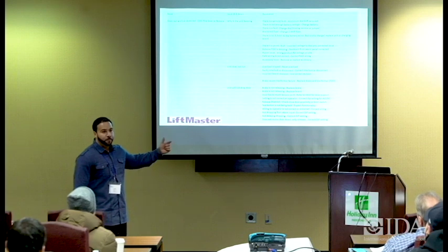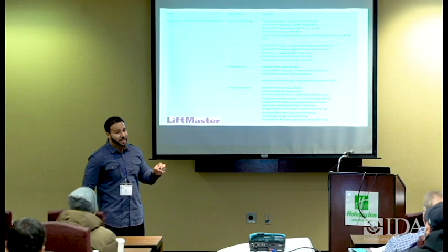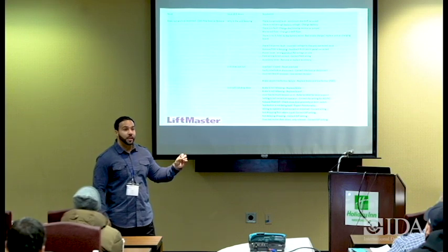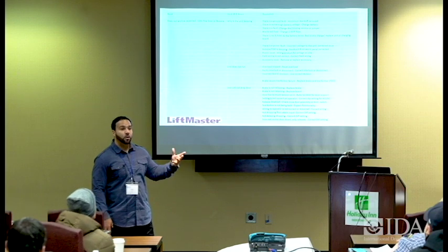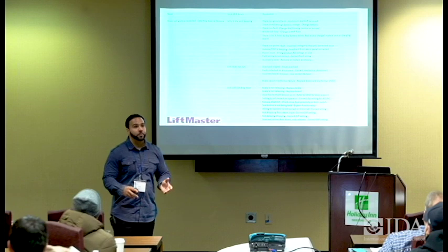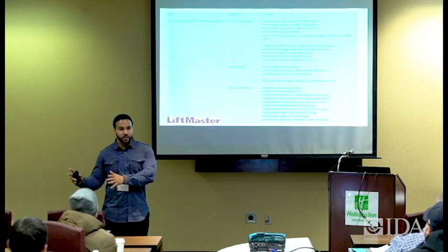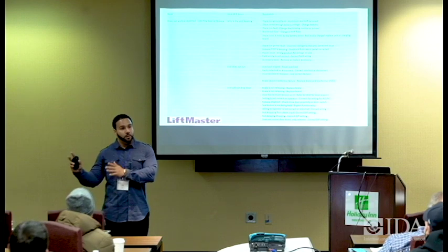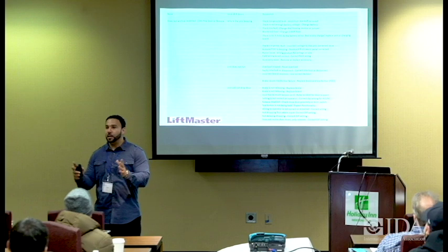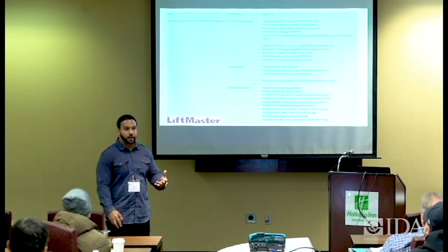We don't want them pulling power off the transformer. Our transformer in this unit is a 75 VA. That's about as high as we want to go. It's taking a lot of juice just to power up all the extra devices that are connected. Now if you want to hook up three safety devices, motion mod, loop detector, and all of that, I recommend that you get another transformer, set it to the side, power the units through that transformer and the main power line coming back from the power supply, and then just use dry contacts or an interface relay module to do the connection from the C-form dry contact. Okay, that's what I would recommend.